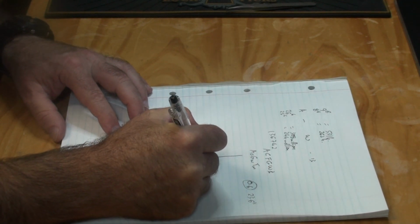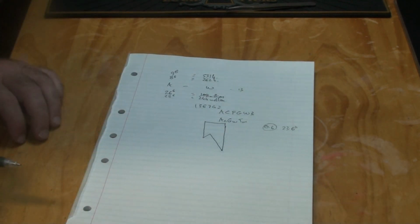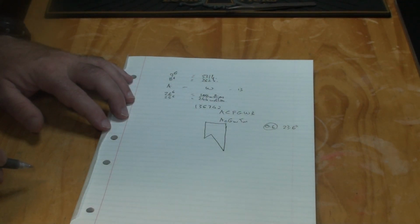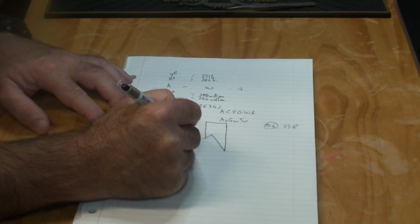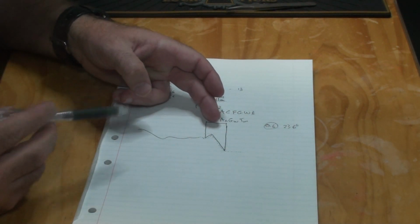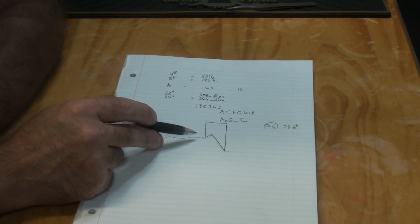So I'm just going to draw one random kind of a key pin that might look about like that. So there's our key pin, and let's have a think about the key bitting that fits that. We've got a key that has a cut that looks like that, and then it goes on to the rest of the key, and that bitting raises this pin to the shear line, and that gets us into the lock.